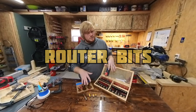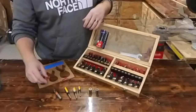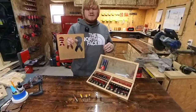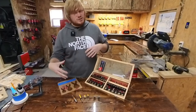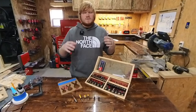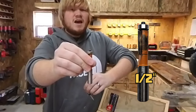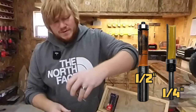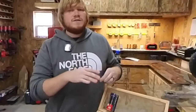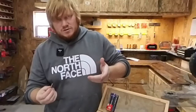Let's talk about router bits for a little bit. There are a ton of different router bits available to you. In order to use these templates, you will need to get some flush cut router bits. Flush cut router bits come in a couple different varieties — to start out, they have different diameters. This is a half inch diameter, this guy is a fourth inch diameter. You need to know which one fits into your router so that you buy the correct bit.